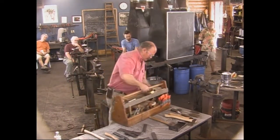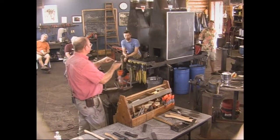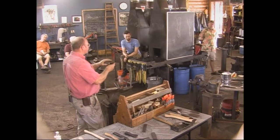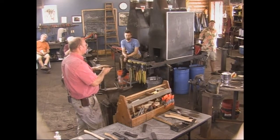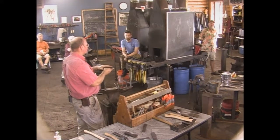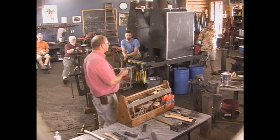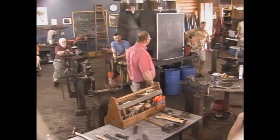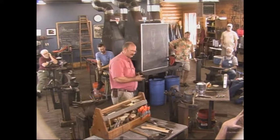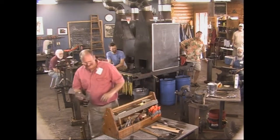If you want to do that, do it before you fold it: weld another piece of tool steel in the back. You could use this as a woodworking tool and drive a wooden wedge or something of that sort, and you can get away with that. If you're driving nails with this, it's going to deform pretty fast, and if you're hitting steel tools with it, it's going to deform. You're just going to booger it all up, and it's going to be ugly. You can see plenty of old axes that look that way. Half of the axes you find at garage sales are all mushroomed over because somebody's been using them as a hammer, and they aren't hammers. They've been driving wedges, probably. You should use plastic wedges. Or a wooden glut.